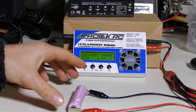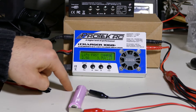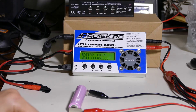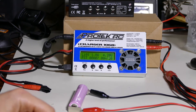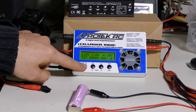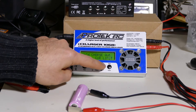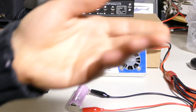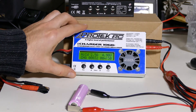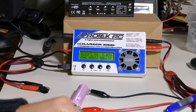I'm going to try charging this quickly to about 4.1 volts. I have it on LiPo fast charge, 1 cell, 3.7 volts, 2.5 amps. It's hitting at about 1 to 1.1 amps — this is still going to take too long. So I'm going to switch to nickel cadmium at 2 amps, charging roughly at 1C. We're charging at 2.5 amps now, and we have to keep our eye on this since we're not in lithium mode — checking every 15 minutes on the multimeter until we get about 4.1 volts.